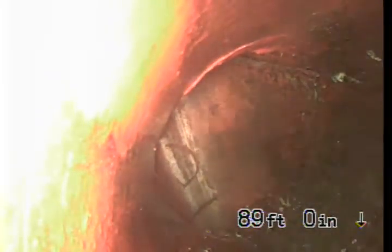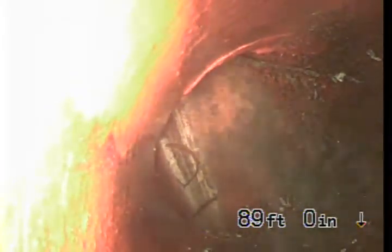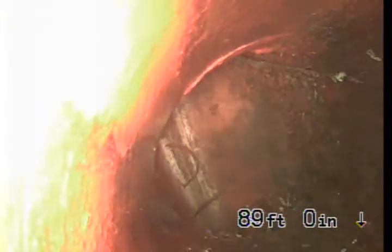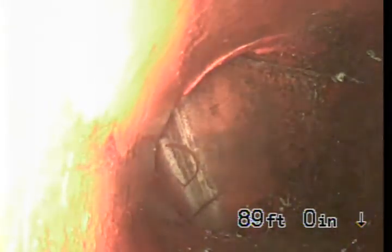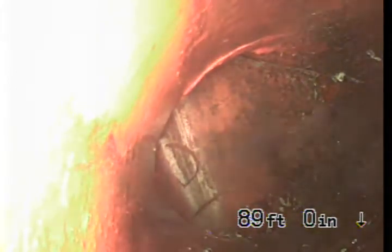The line that I'm dealing with — this 90 feet — has what's called an epoxy liner in it. That's where they put a new pipe inside of an old pipe. It's very thin, but it's epoxy — basically like a stent. And there are a couple spots where there's some newer ABS pipe in between. So there'll be a section of lined pipe and then a couple ABS fittings, which is probably where other parts of the house connect to this pipe. They probably lined the whole thing and then couldn't get access — once they line it, it shuts off the T going to it, so they have to cut it open, dig, and reconnect. There are two or three spots where that's happening.